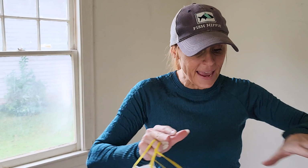Cleanup isn't just inside, it's outside. So when you're pulling off siding or you're scraping paint or something, you're gonna get paint chips and nails outside. You're gonna wanna put something down to collect all that trash. And you're thinking maybe, oh, the nails are magnetic, you can use a magnet to pick them up. Not always. In this house, the nails were aluminum, and we had to pick them up one by one.